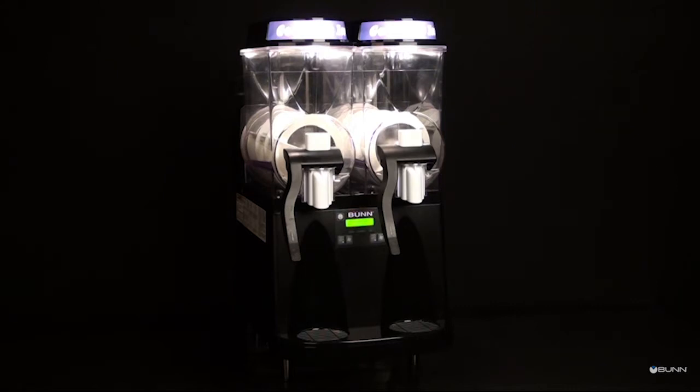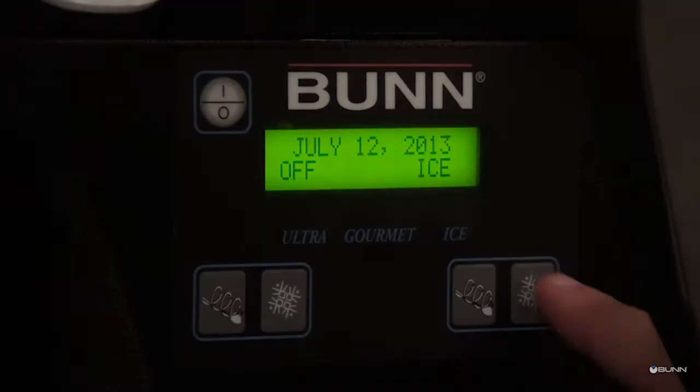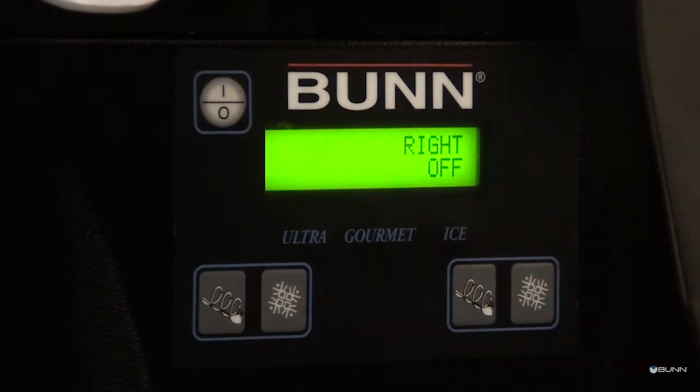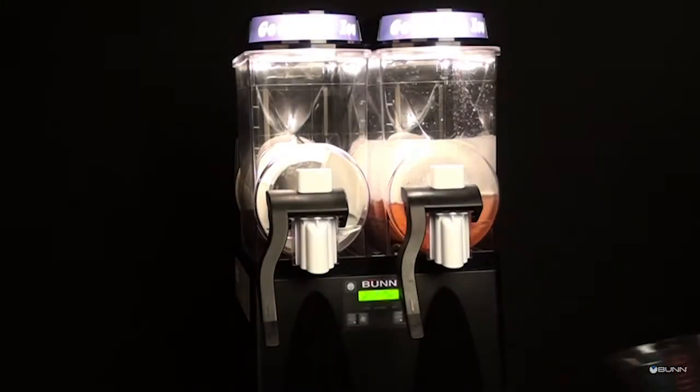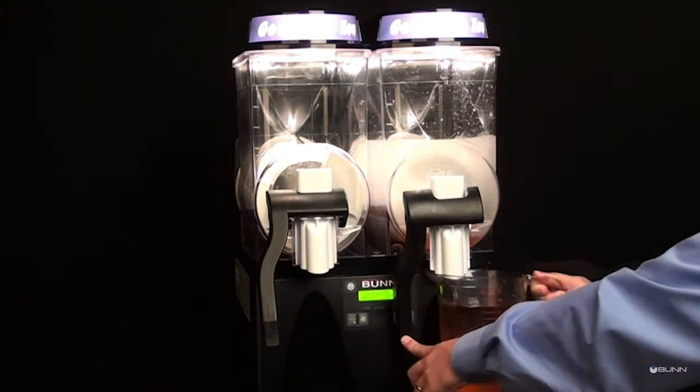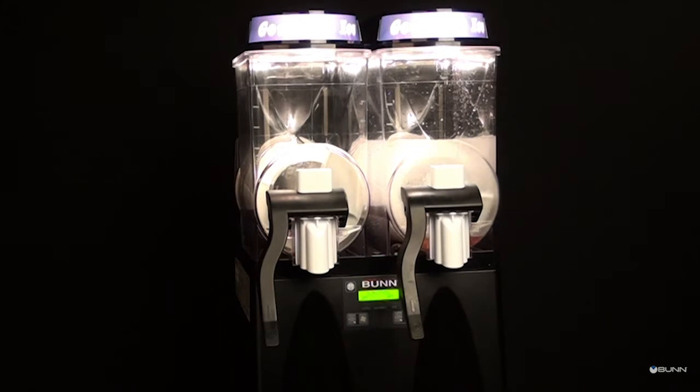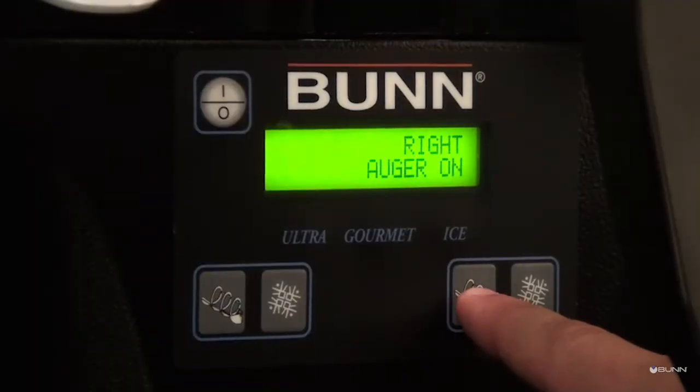This video will demonstrate how to properly perform the recommended cleaning process for the Ultra HP frozen beverage system. Frequency of cleaning should be as directed by the product manufacturer. Turn cooling off. Empty all products from the hoppers. Turn auger off.